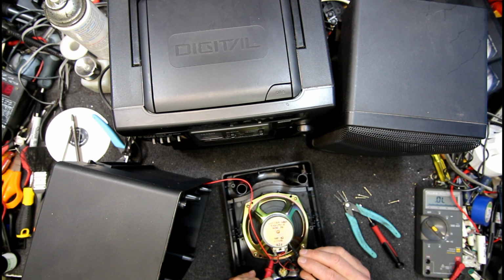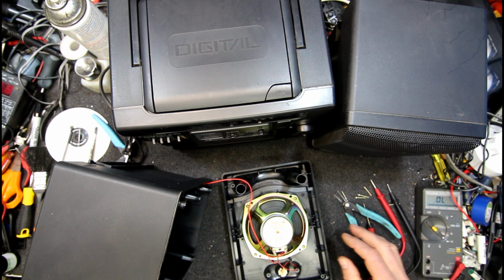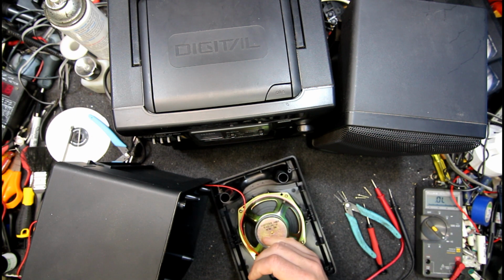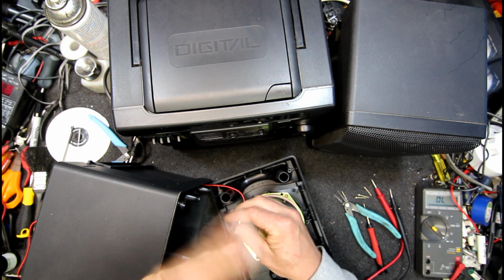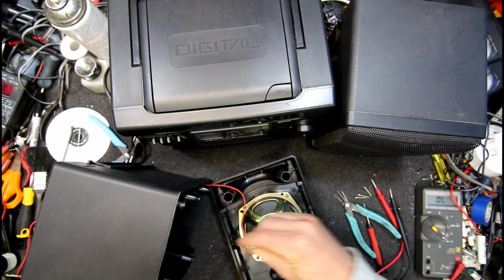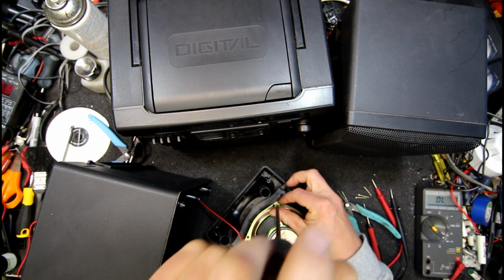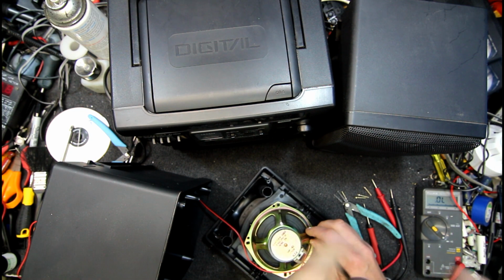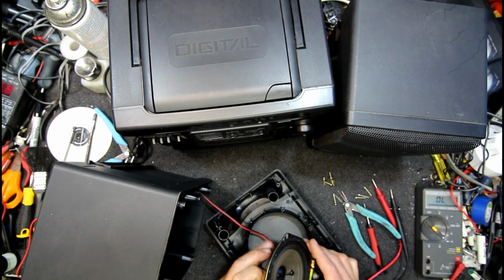Yeah, nothing down there at all. So maybe it's up in the actual, under the dust cap there somewhere. Because I don't remember it saying anything about a dodgy speaker. Usually it's the last thing to fail on these sort of things, but it goes to show it's probably one of the reasons this thing got chucked out. Intermittent speaker as well as faulty CD player.